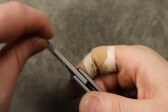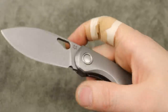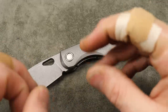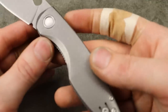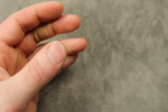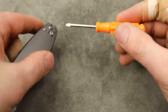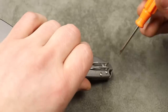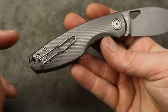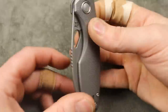It gets down to 20 thousandths behind the edge, so it's slightly on the robust side, but when we start talking about M398 I can kind of understand that. Also, T6 screws — I don't like T6s. I'd rather see T8s all the way around. The clip screw is still a T8, but the body screws are T6s. Why not just do T8s all the way around? Why put those two body screws as T6s? I just don't understand that. So that's a negative.